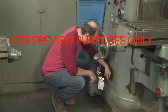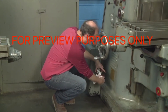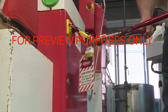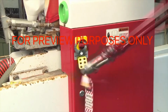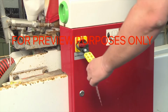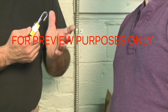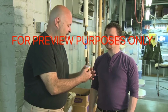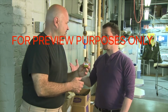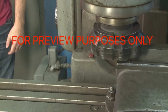Each employee who installed a lockout-tagout device on the machine must then personally remove the device. In emergency situations, management personnel can be authorized to remove a device, but only when the original employee is unavailable and cannot be easily recalled. When this happens, the employee whose lock was removed must be told why the lock was removed before he resumes his work. Once all the lockout-tagout devices have been removed, the equipment should be test run.